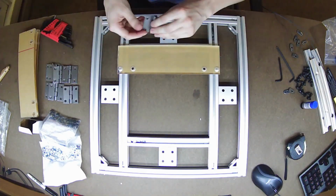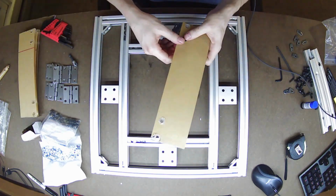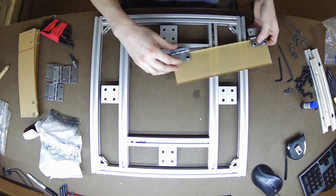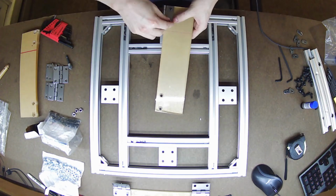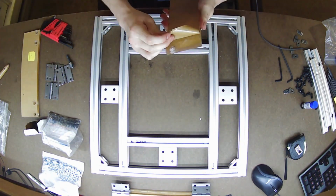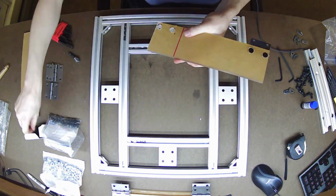After preparing all the panels, it was time to install them. This process was pretty straightforward. Just removal of the film from one side of each panel, and then stick through the flathead screw from the countersunk side, stick it all the way through the drilled out hinge, and then into a low profile lock nut on the far side.